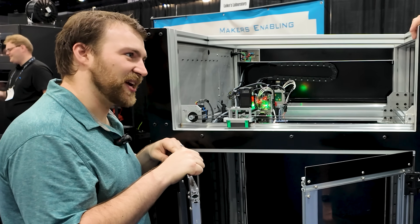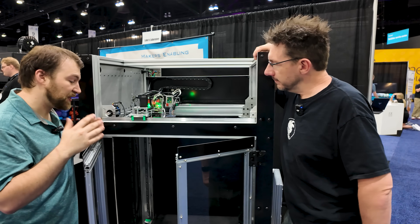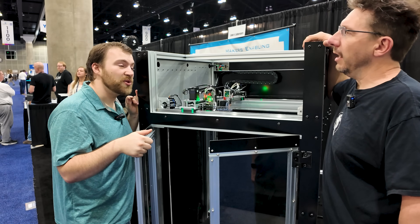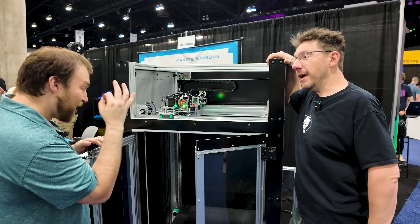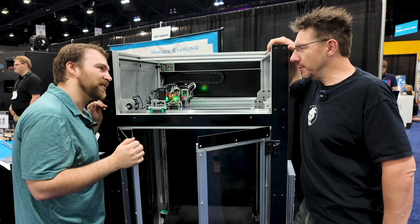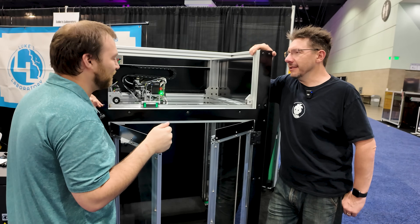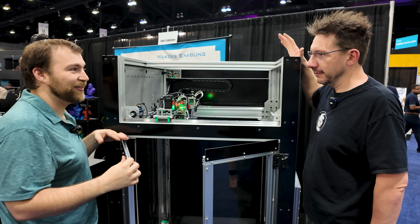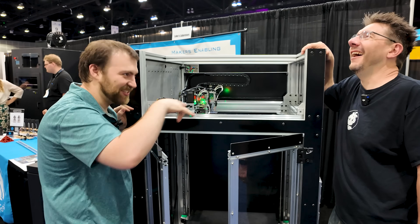Polycarbonate is one material you actually want to print hotter — pure polycarbonate like what 3DX Tech makes is really recommended at 100°C plus for chamber temperatures. You can get away with 70, mostly get away with 90, but in a proper scenario when you're printing big you need a pristine chamber temperature. That's about 330-340°C on the nozzle. The tube hot end can do 500°C all day. And at speed too — running Klipper with input shaping, closed-loop servos running FOC controls, you're not looking at layer shifting with a servo. There's more than enough power, and we have NEMA 23s on the X axis for that reason.